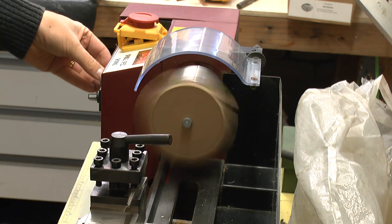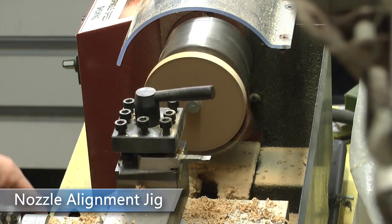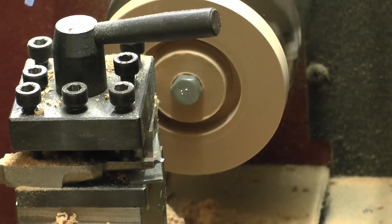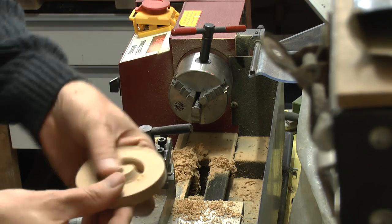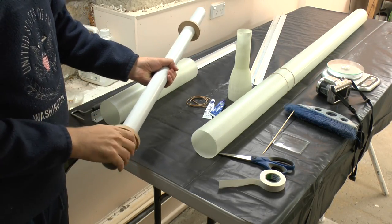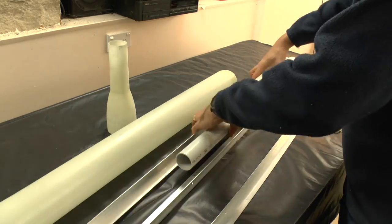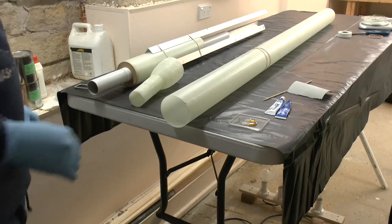Before we do that we machine up more centering rings to create a nozzle alignment jig. The discs pop out and we made two of these — they go over the 40mm PVC pipe, which slides into another 80mm tube. Then we add some angle brackets and hold those down with rubber bands. That's ready to be used after we glue in the tail cone.